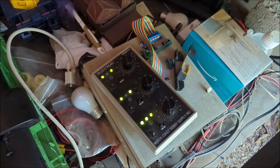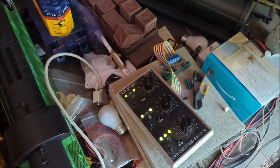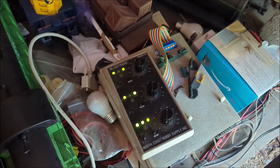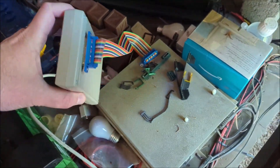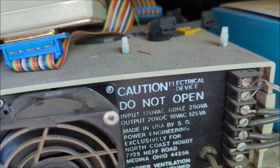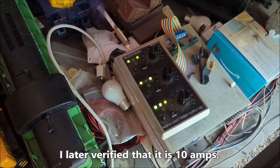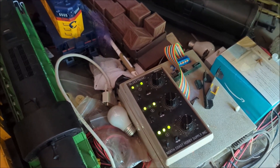I really like this transformer — they don't make it anymore. It hasn't been made for years. I think my family bought it in the early 90s and it's been working great ever since. I did have an issue where it connects directly into a port and something had happened to the solder points — I was losing control ability, so I opened it up and did some jerry rigging to get it mostly resolved. The specs — I think it's 10 amps overall, but that's not 10 amps per channel; it's 10 amps divided amongst the three channels.